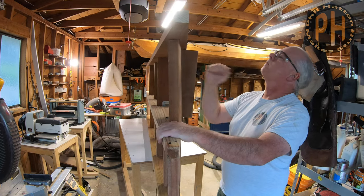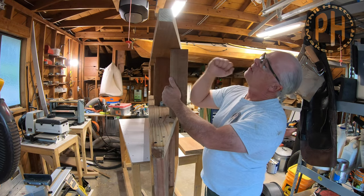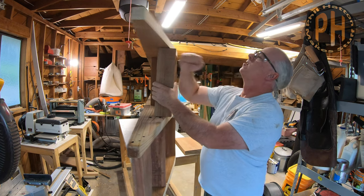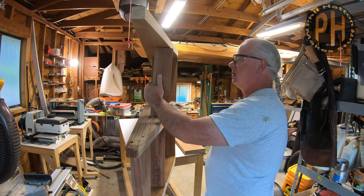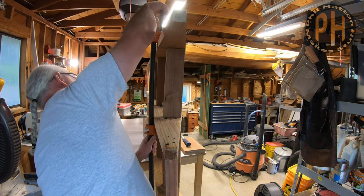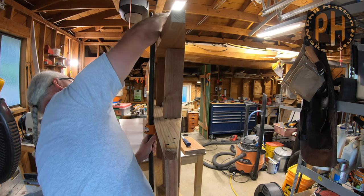Because the wood of the joists was twisting, I used blocking to not only keep the structure together, but to hold the three joists parallel and straight. Galvanized brackets and screws on the inside corners and ledger lock screws through the joists into the ends of the blocking finished that job. Since the blocking isn't supporting anything, and the joists run the length of the bridge, I didn't worry about the number and spacing of fasteners.